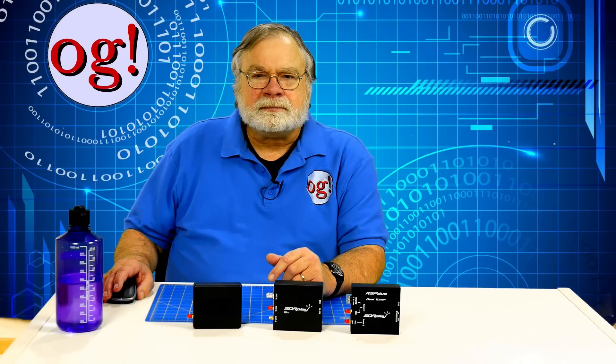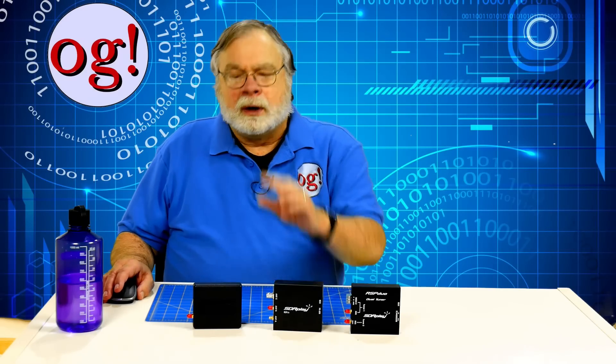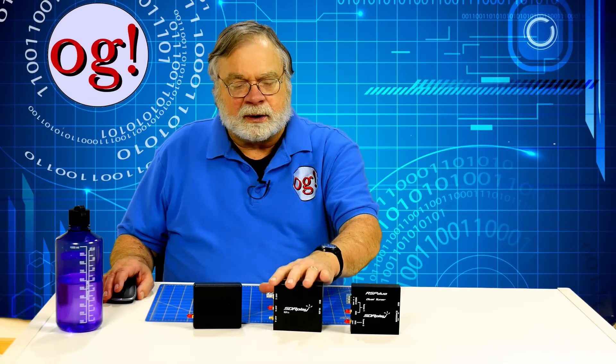Well, I hope you found this useful. Any one of these black boxes makes an excellent software-defined receiver in conjunction with the house software. You can really get an awesome idea of what the spectrum looks like, and all the ham bands are pre-selected with just a single mouse click. There's so much to see. The new RSP-DX features are aimed at the low bands. In addition to the new ham bands, there are navigation beacons, low frequency broadcasting from Europe, and many other strange and interesting signals worth exploring. The new features of the RSP-DX make this part of the band really shine. So yes, I do recommend this radio. Again, it's only a receiver. If your only use case is to create a companion pan adapter for your HF radio, go with the RSP-1A. But if you'd like to explore our new low band ham bands, you'll want the RSP-DX for all of its special low band features.